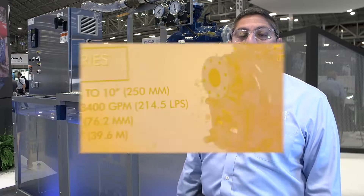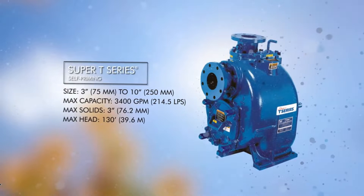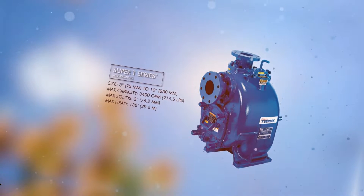Today we're going to talk about our Eradicator Plus solids handling technology, but I want to first start by talking about our pump product. In 1960, Gorman-Rupp introduced the T-Series pump, primarily for handling municipal waste. It was designed to pass a full 3-inch solid through in its 4 through 10-inch models. Over the years, we've made some improvements, mostly for our customers for maintenance.